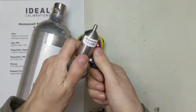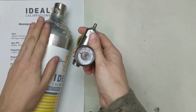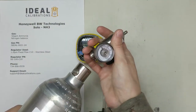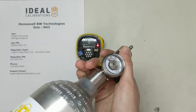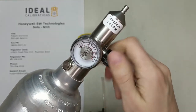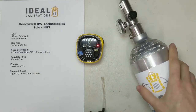The first thing I'm going to do is take my regulator and open up the valve all the way. That's really important — we don't want any moisture to get into the cylinder. It can get trapped in there from room air, so we want to open this valve so it blows upward through there and blasts all the air out. Screw this in and then go ahead and close the valve. It doesn't waste much gas — it's just a good idea for keeping your cylinder stable. Now let's take our tubing and put it on the end here.